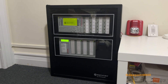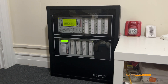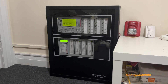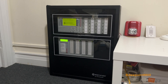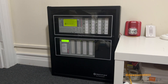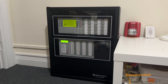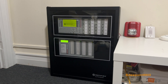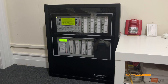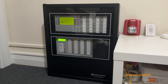That's it for the NFS-640 and NCA. These will be discontinued by the late 2000s, being replaced with the NFS-2640 and NCA2 respectively. Out of all the ONIX series panels, the NFS-640 may rank the lowest — especially due to its unreliable power supply. Nonetheless, it is still a very powerful and flexible fire panel, and like the AFP-400, it's compact while still providing a variety of high-end features. If you happen to acquire an NFS-640, while it may rank the lowest in the ONIX series, it is still one of the best panels a hobbyist can get. It can be programmed from the front keypad using the KDM-2, provides FlashScan addressable protocol, networking options, and a variety of peripherals. The NCA is a great option for anyone interested in a Notifier network system — it supports both ONIX series and AFP series panels, allowing for great flexibility, and serves as a great head-end to a network of panels.